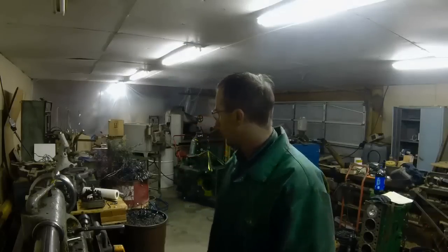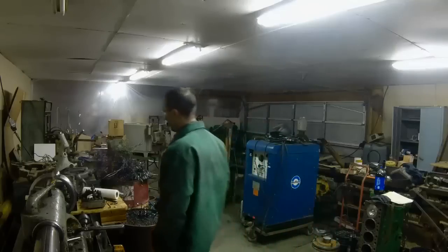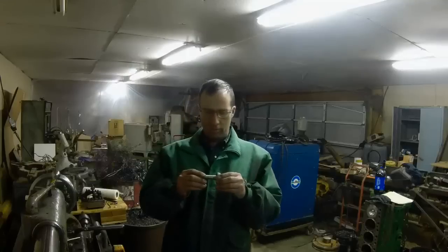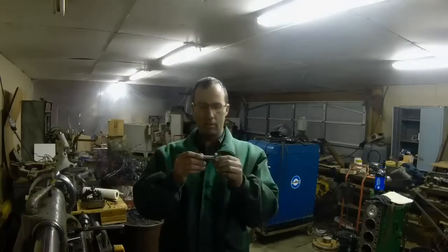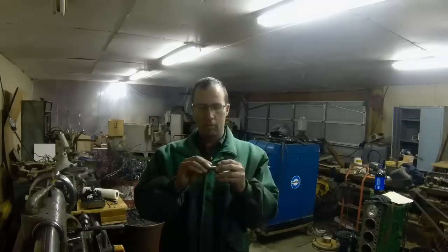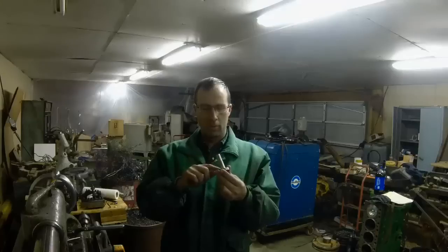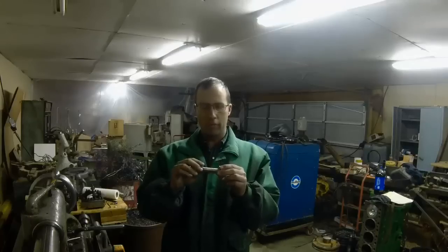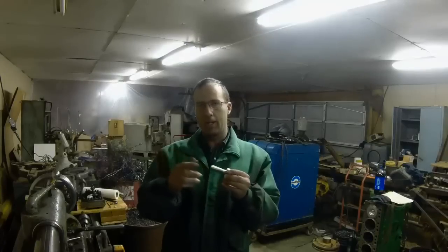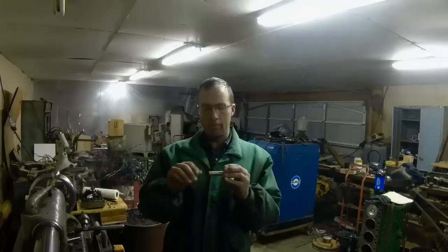The main one being I'm going to revisit heat treating these tappets. Got another batch of these I've made. So what I'm going to do this time is get some stainless tool wrap and wrap these suckers up, or try to keep some scale off of them, so there'll be a little less problem about them not wanting to finish out, like I had some of them before that wouldn't clean up. So I'm going to wrap these dudes up.